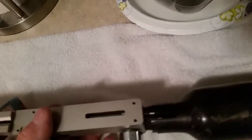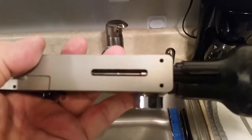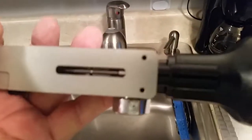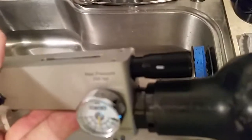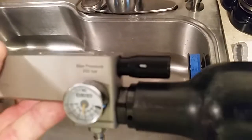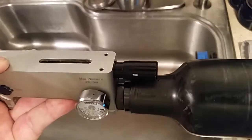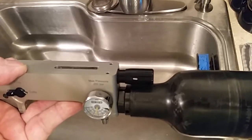Submarining it underwater in the sink seems pretty drastic but really it's not. Right now I don't even have the hammer or spring or any of that stuff in here. Let me bring it to the light and show you. All I've got is the valve rod, and on the tip of the valve rod I've got the C1 hammer stop, the black connector piece, and valve return spring.